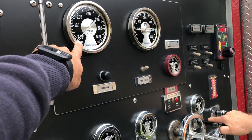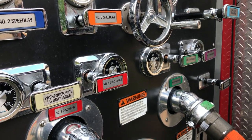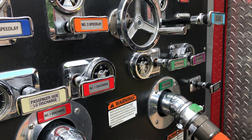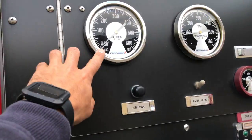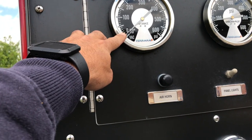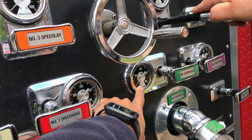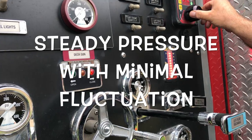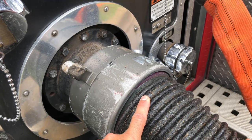Key note: watch your intake gauge. As long as you're in vacuum, you're good. When you open up the discharge you're flowing off — whether it's a supply line to another engine or a discharge off the panel — listen to the engine. If you're having issues, you're going to hear a hiccup. Watch your gauges: your intake gauge should be in vacuum. These gauges aren't the greatest, but when they're below zero, you're in vacuum. When you have your supply and you've got a draft, you're going to see it's flowing water. If you look at your hard suction, you'll see the water flowing through it.